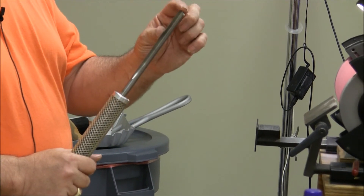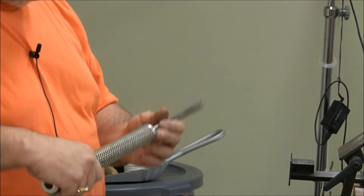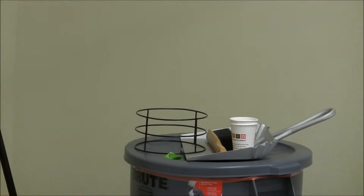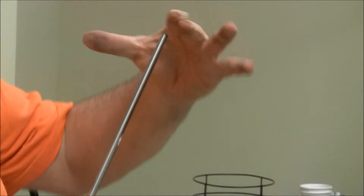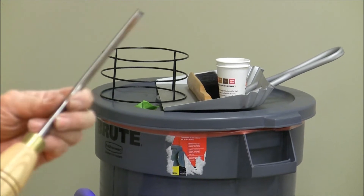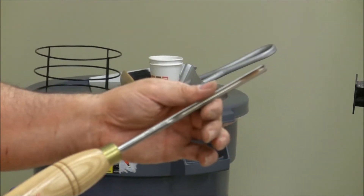The second grind — the first one I changed the angle on it. So that works real well for getting through the bottom of the bowl. And it's the same thing — I've got a little quarter-inch gouge, which is even flatter than that one. With this one I can go through the bottom of a bowl and take a cut so fine that I generally start sanding at about 220 or 320. You just take a real fine cut across the bottom and it works real well.